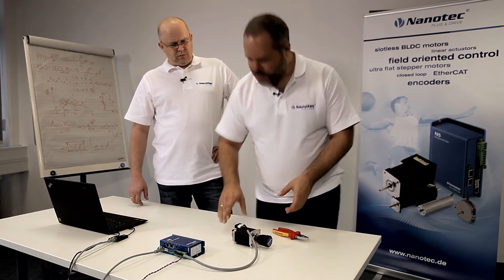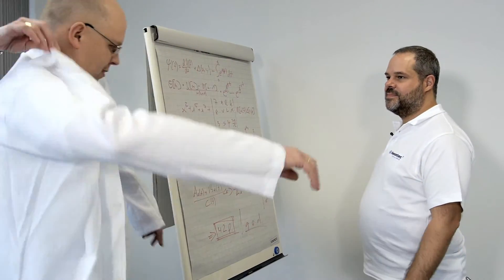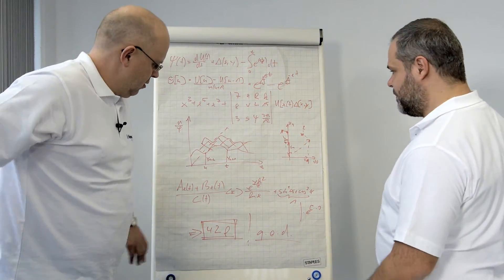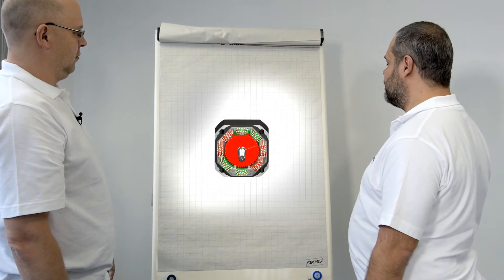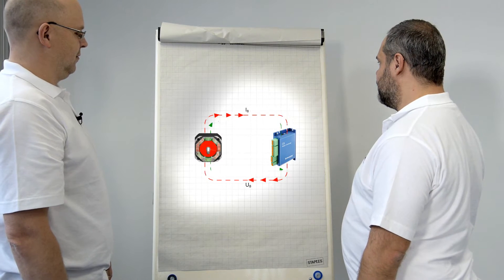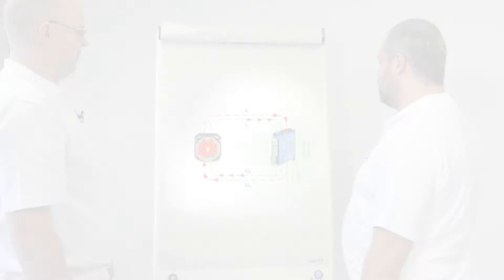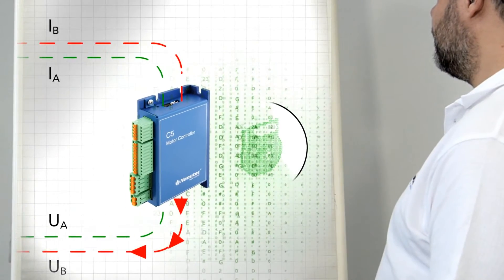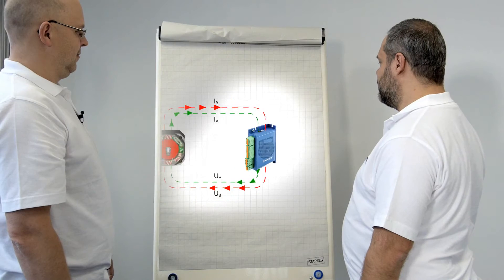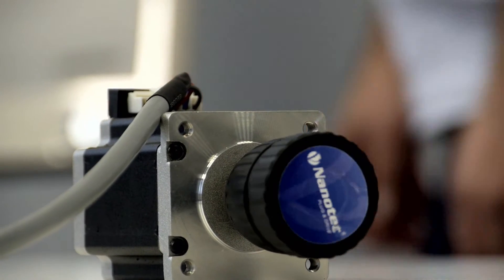But how does it actually work, Frank? Well, Markus, that's not so easy. We have a mathematical model in the motor's controller that is updated in each control cycle with the voltages and currents in the motor phases. Through the retroactive effect of the motor, also known as back EMF, the rotor position can be determined. The induced voltage isn't measured like the simple BLDC sensorless algorithms in a particular phase, but is calculated in this model. The more accurate the model parameters — resistance, inductance, and magnetic flux — the better the estimate of the rotor position.